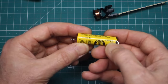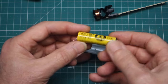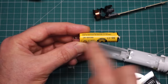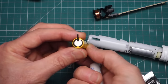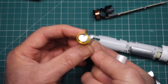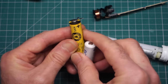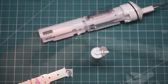Looking at the battery — nickel cadmium, don't really want to use those anymore. There's a date code: 613, so that's about five years old. It looks to be around 600 mAh double-A sized. No problem — the nickel metal hydride should fit in its place. In terms of these two metal strips, I might try to reuse those by pulling them off very gently and re-welding them. I've got a battery spot welder and can pop a couple of welds on. If you don't have a battery spot welder, just solder directly to the end — that shouldn't be a problem.